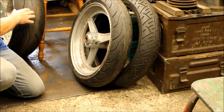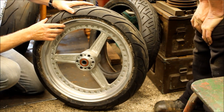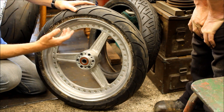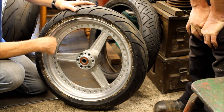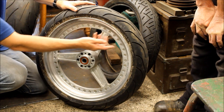What we've got here is the front again. And this has got a slight problem because when it was made, it's actually made out of the rim of an Astrolite wheel, which was damaged. Yeah, the centre was damaged. And Astrolite's now worth a bloody fortune, like £1,000 to buy a new one. But what Jeff did very cleverly was cut it out and then drill out the rivets that hold it all together and then reuse those holes for bolts.